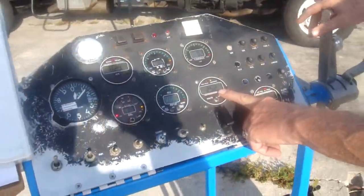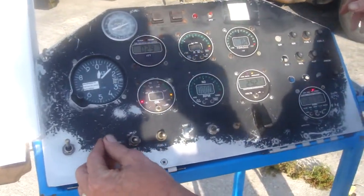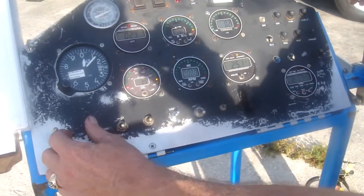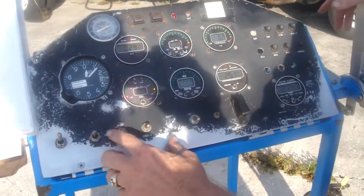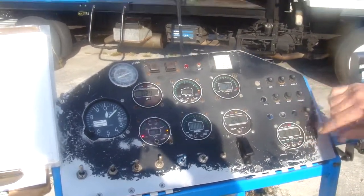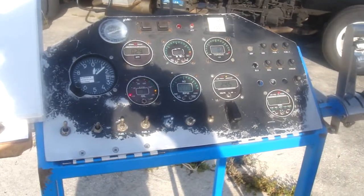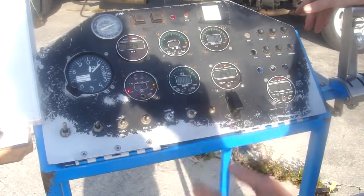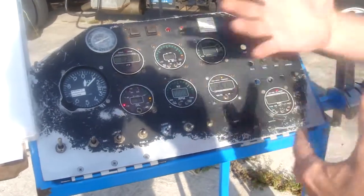We've got all our normal settings. I've got over 25 volts. We're in discharge because obviously we're not making power. We have a tester here — you'll have one of these to test the exciters. We can test the right, we can test the left. This turns on the fuel pumps, at which point we'd get fuel pressure. This gauge here actually measures total gallons, and we can also look at fuel flow. When we get into operation, we'll be watching fuel flow as one of our standards. The start switch up gets the start module going — that causes ignition events and so on.